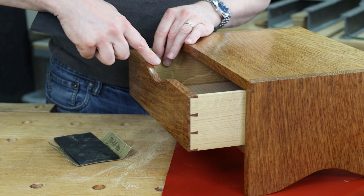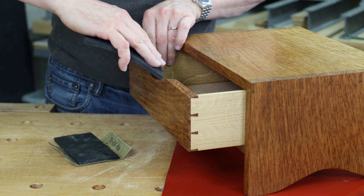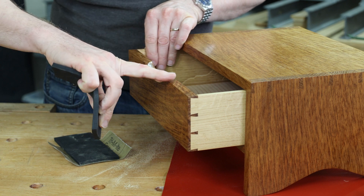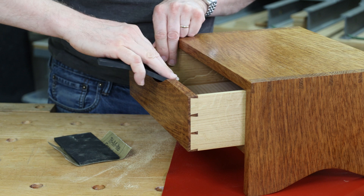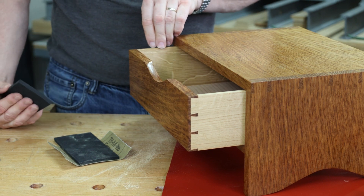For getting inside a curve like this, I'd probably use my mid-sized block. It's great for following that curve and softening the edges. We want to keep things crisp and uniform, so getting the right thickness block with your abrasive around it is just going to get that shape in beautifully.